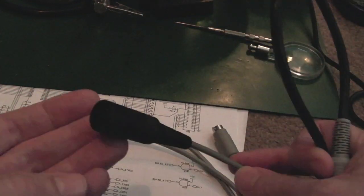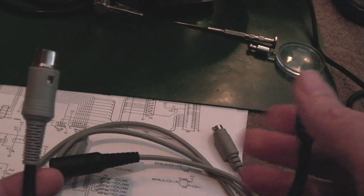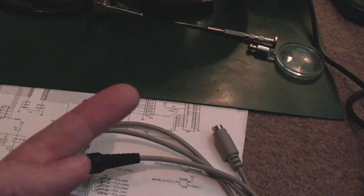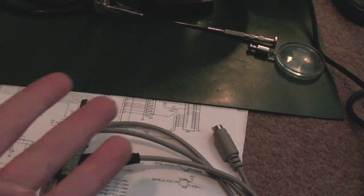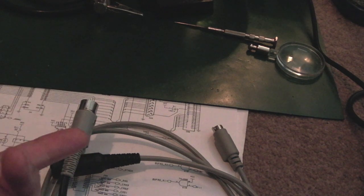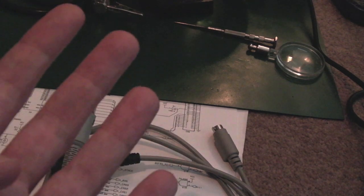I can always revisit this and pull a couple of wires out to a serial connector, giving you a serial port on the CD32. The stuff I've shown you in these videos: you've generally just got power, ground, data, and clock — those are the four things you need for any of the Amigas: A1000, A2000, A3000, A4000, CD32, A500, A600, A1200, and so on.